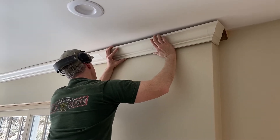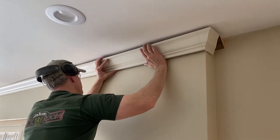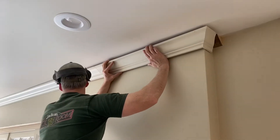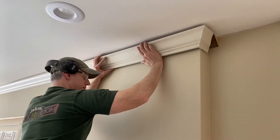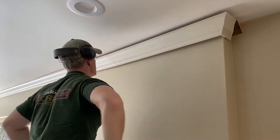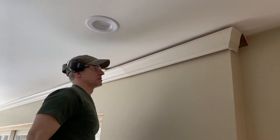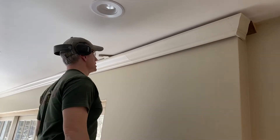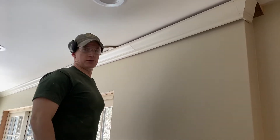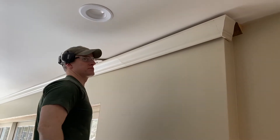This corner has been an absolute pleasure, hasn't it? Yeah, it's been awesome. There are some irregularities in it a little bit. Chris has just glued those two pieces together — we already glued this edge on. We're going to leave it hanging until we get our next piece on down there, because we use the cope joint here to set the angle in the corner. There was a hump in the ceiling down here and another one here where the sheets were put together, and there was a little bit of a wave here in the wall. To put this lap joint together without gluing it, I think, would have been next to impossible — a lot of sanding and caulk, wood filler, whatever, to try to get it to look right. So we kind of worked from the corner back and did our outside 45 on both pieces and glued.